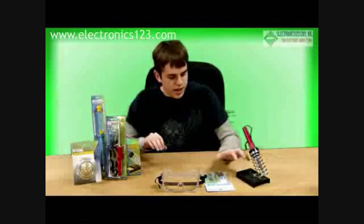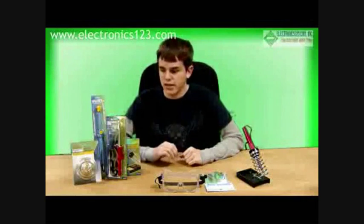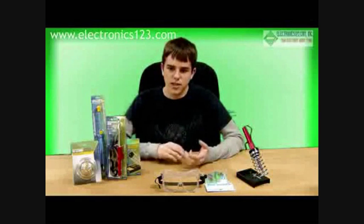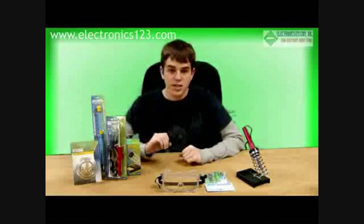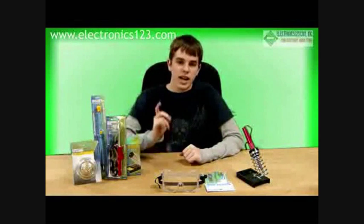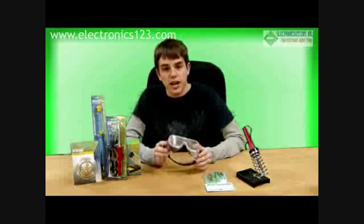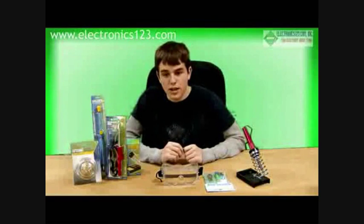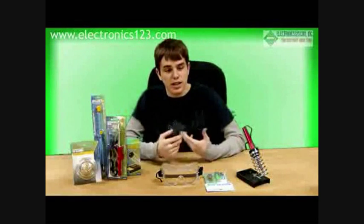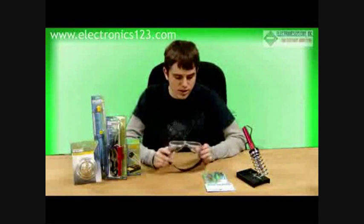It's a good idea to have a soldering stand, and something to clean the tip of your soldering iron with. You don't want too much forming on the end of the tip because it'll wear it out faster and you'll get dry joints. Also, a good thing to have is a desoldering pump in case you make mistakes. Last, and most certainly not least, is a good set of goggles or some kind of eye protection. If you have any air bubbles in your solder you can get popping, and it'll send droplets of solder — you definitely don't want to get any of that in your eyes.